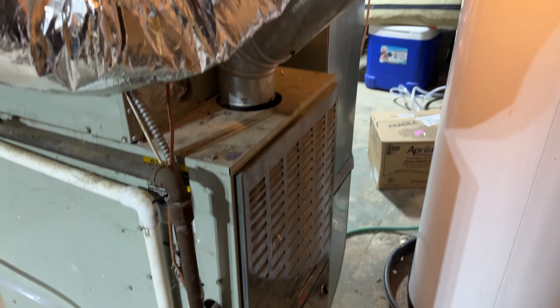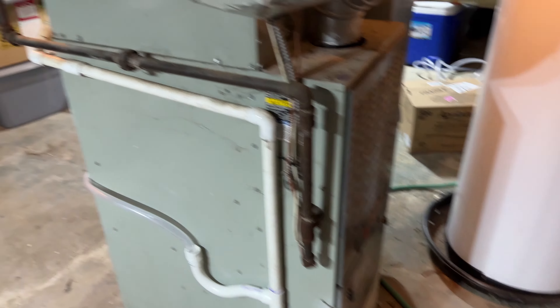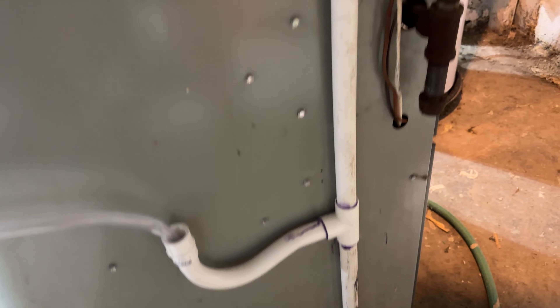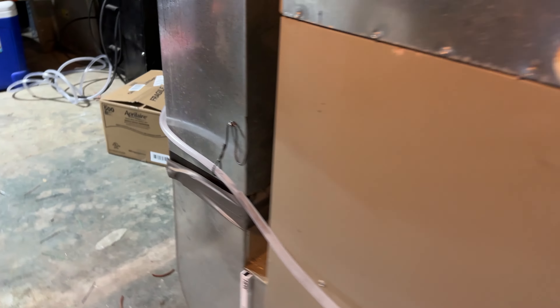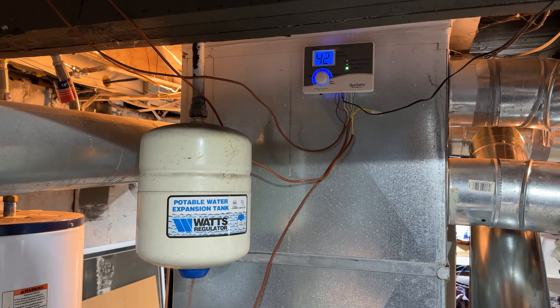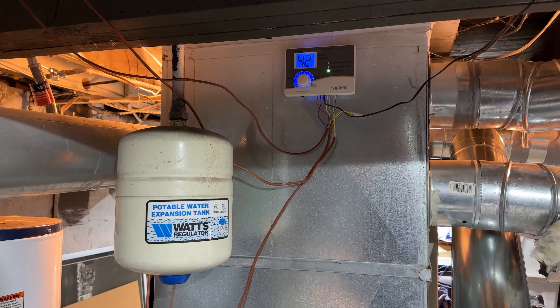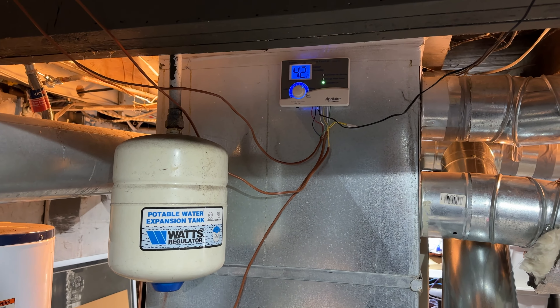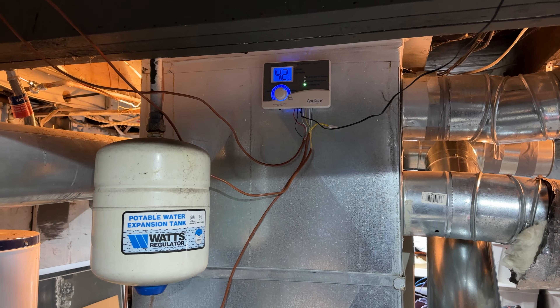The wiring on this took me quite a while to figure out. I had the connection for the hot water, and I also piped the drain right into my AC drain line and clamped it in, so my drainage goes to the floor drain. The problem I had while testing this unit - I was trying to figure out why it wasn't turning on. If the humidity is above 45%, this unit will not kick in. So nothing I was doing was working until I realized it will not operate unless humidity is under 45%. Good to know - nothing in the instructions made that obvious, so I kind of had to learn it on the fly.